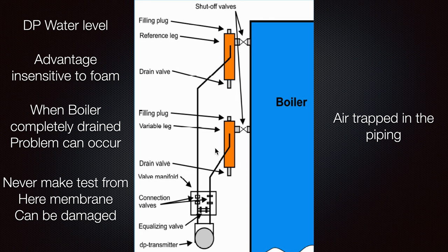What is necessary to do: first of all, you need to shut off these valves on the top so you will not have any pressure coming from these plugs. When unplugging the top plugs, make sure you are standing far away with your hands covered and your head covered with a mask, so you will not get any hot water on your face or hands.